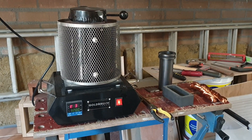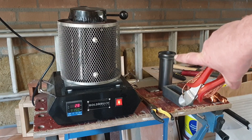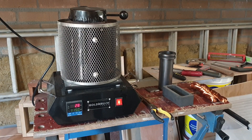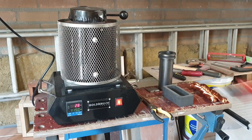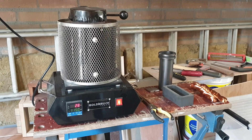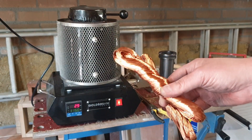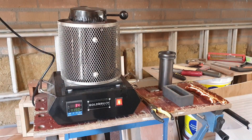Let's let this thing heat up a bit. I got a new crucible for this because I don't want to use the crucible that has all the brass leftovers in it. I'm going to snip this wire into manageable pieces so that it will fit completely in there. When that is molten, I'll add the two degaussing cables which are a lot thinner and will probably melt fast. When that is all molten, I'll add the little tin ingots, mix it around, let it heat up some more, and then pour it.